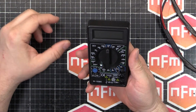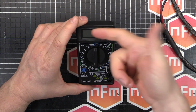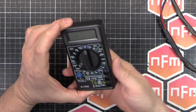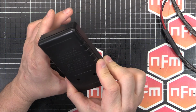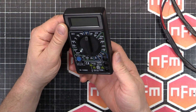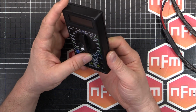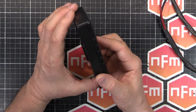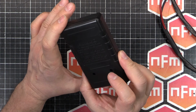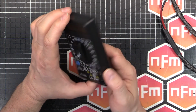Yeah, so I'll give this thing one thumbs up because it is reading pretty good, but I've got to give it a thumbs down because the input protection is almost non-existent. It does have a fuse, a glass fuse, but there's nothing else there. So, I can't really recommend it in good conscience, because if you do hook it up to something big and bad, like a mains outlet, and it does go bang, it's going to really go bang.